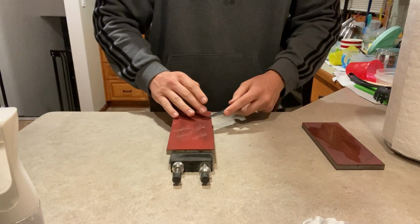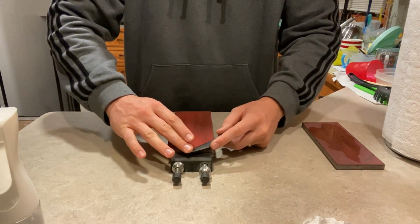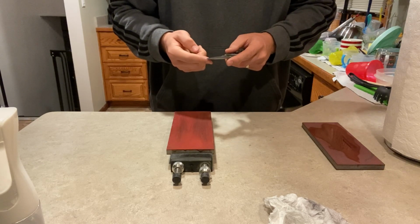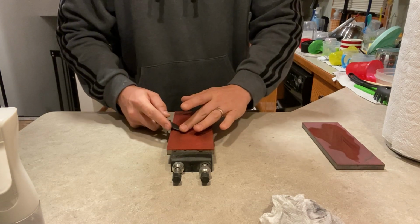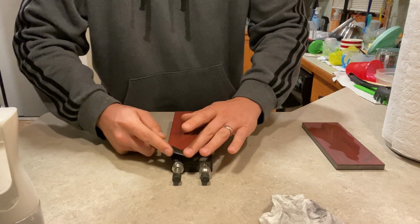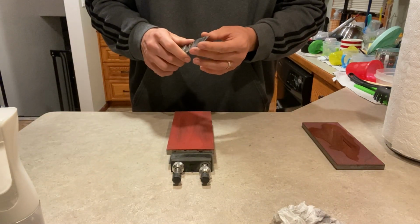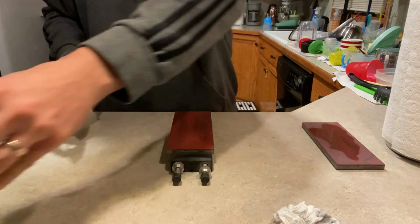Let's try to ease into this a little bit. Some stroppage. Cutting off the burr, or attempting to. I find personally that a stropping stroke doesn't seem to set up a burr cutoff very well. Like I said, I'm trying to do this very delicate-like, and so might be okay. No, I can definitely still tell there's burr on there.